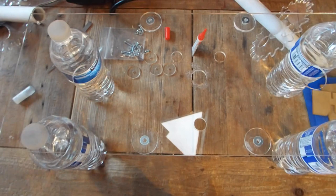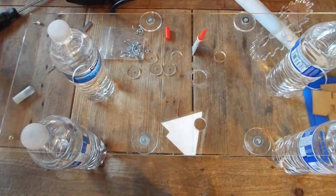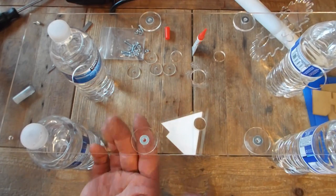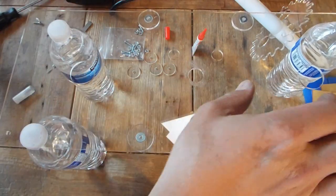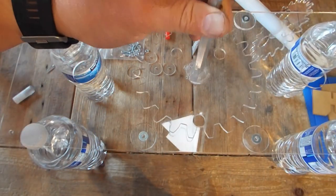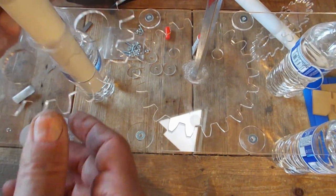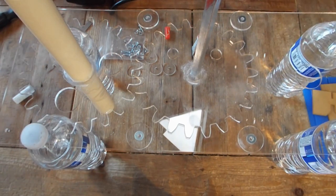Okay, so back to putting the shaft on. I see a little bit of debris on the back side of the plate, because these acrylic plates are very staticky. Just make sure there's nothing sandwiched on the top side of it. It looks clean on the top side, because whatever you pinch in here is going to be stuck in here and grinding against your gears. And we're just going to take our gears and set them down in this plate as it's sitting up in the air.